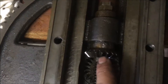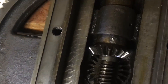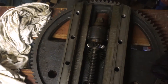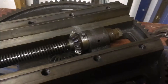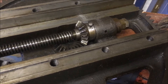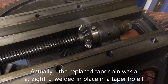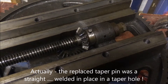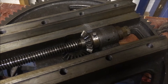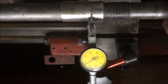Just cleaning this up — and what a marvellous job they've done: they've actually welded the taper pin on both sides, just to make sure it never moves, which is a pain in the arse. After a bit of hand filing the welds are off, and then it was just a case of determining which end was the thinnest. Fortunately the first guess was right — pull that out, pull the pin out, then undo the two nuts on the end and hopefully slide that up out. This is the stroke adjust shaft.